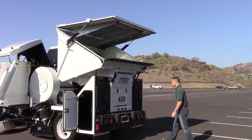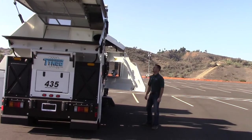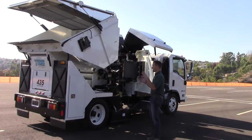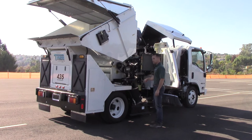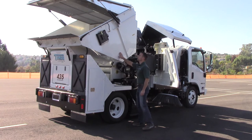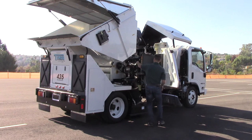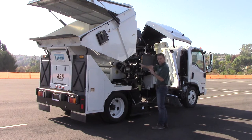Coming over to the other side, you get a good picture of the dust separator. When the sweeper is down, we're using the blower wheel, pressurizing the pickup head, and it's coming out of that blast orifice, air blasting the pavement. Because the blower wheel is moving, we're pulling air up the suction tube. The heavies fall on the bottom of the hopper. The fines and the rest of the airstream go up through the hopper screen, then through this dust separator, which is our primary means of separating the dust and dust control.